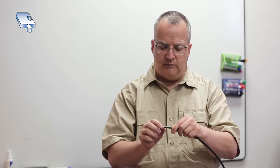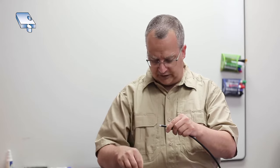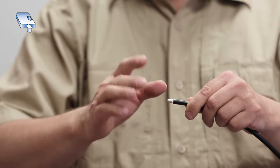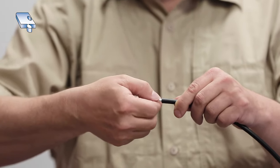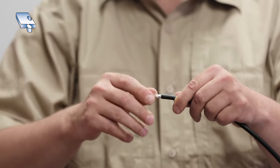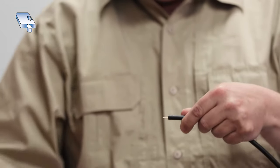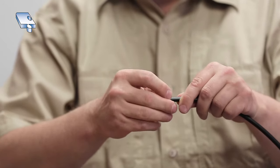Once done, pull the tool off and you'll see a silver piece exposed and the first shell is exposed. Pull that off and give it a twist. If it just falls off, you may be cutting too deep — what will happen is you'll actually damage the copper.